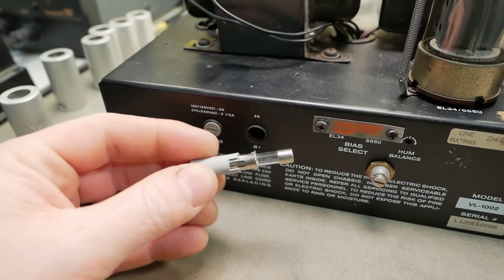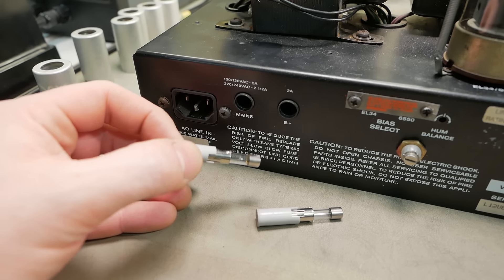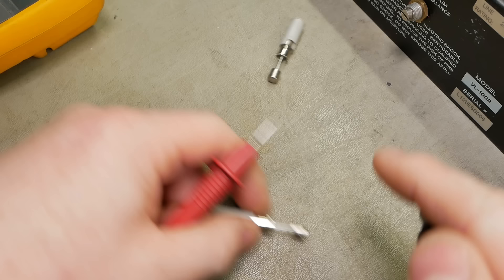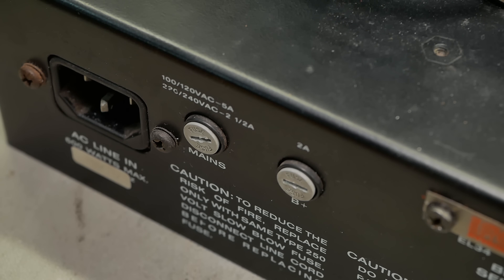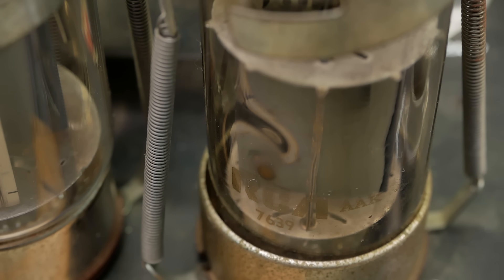Let's have a look at the fuses. The HT two-amp fuse looks visually okay, but let me check. Continuity test on the HT fuse — we've got continuity, and on the mains fuse as well. It's always a bit of a worry when the fuse ratings are correct and they've got continuity. But with reports of smoke being emitted and an output valve sucking its cheeks in — I know the camera puts on ten pounds, but RCA, you don't have to be so vain. Let's flip it over and see what we're dealing with.